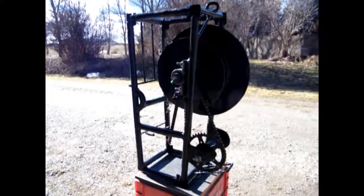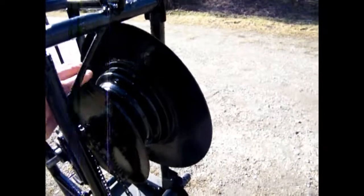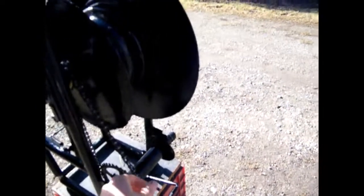This is a 12 to 1 pulley reducer. So 150 feet of rope played out from the top spool will cause 12 feet of cable to be pulled up on the bottom spool. I've got a nice chain tensioner working, and I've got a disc brake working too.